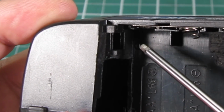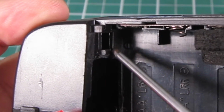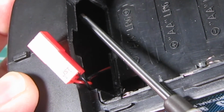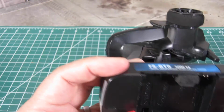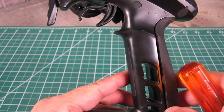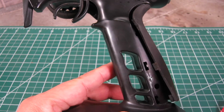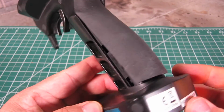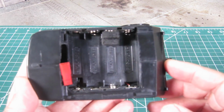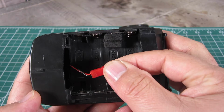Third, you'll need to remove the female JST connector from the current stock location. It took a bit of effort. By using the hole, I was able to take it out of the current position. It also helps to remove the screws on the handle and the base by prying it a bit open to have better access to it. You can prop the rubber piece out to have access to the screws. They'll let you widen the base. Once you're done, the battery tray will look like this. The JST connector is long enough that you can easily connect your battery.